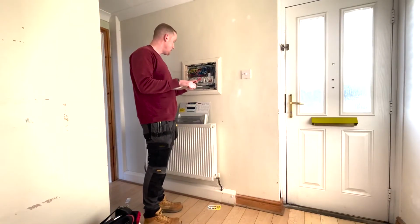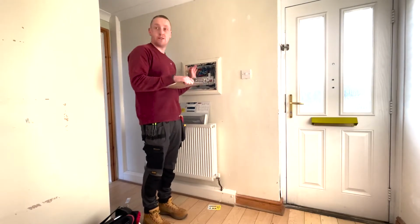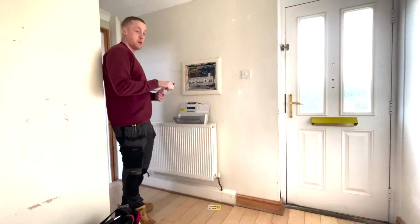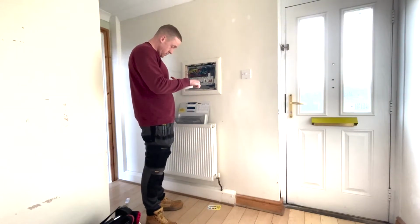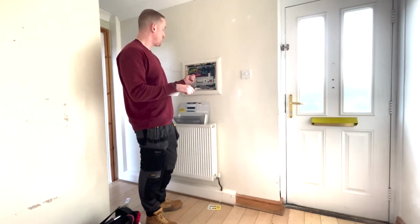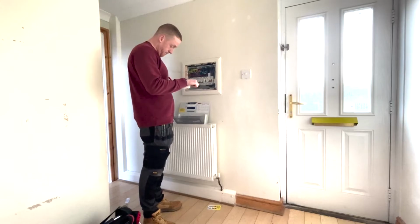Oh, that's a bit odd. Got a downstairs socket on a 16 amp MCB. So I'm assuming we're not going to get end to ends on that. It's been a fault at some point and someone just downgraded it. But we'll see. What's your thoughts on that? Because I know people who won't do that. They split it on two different circuits, which I suppose doesn't matter, two separate radials, as long as you took the broken bit out. I suppose it doesn't matter, does it?